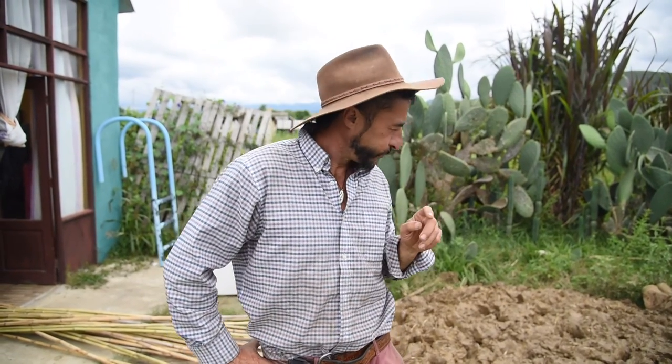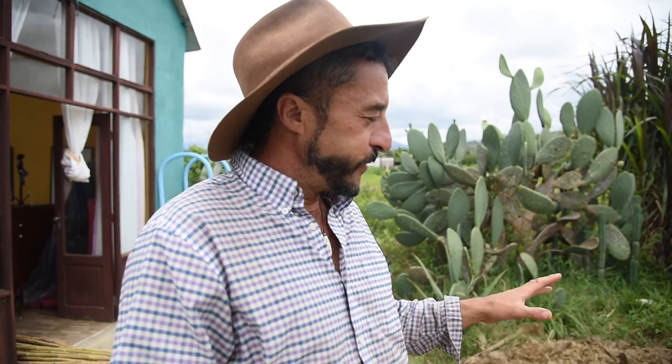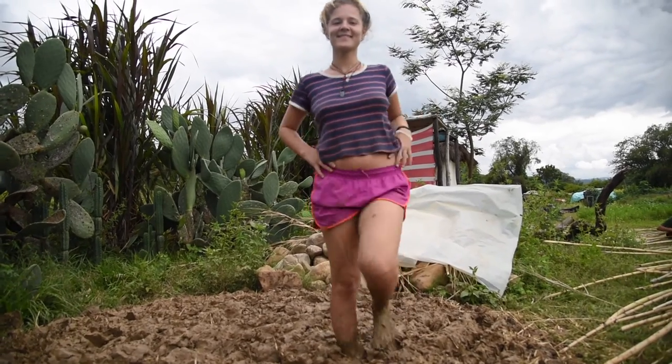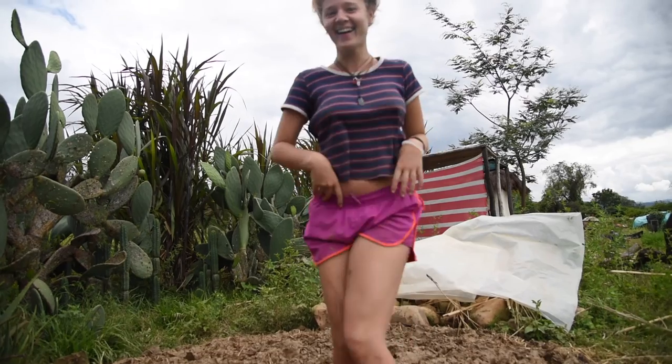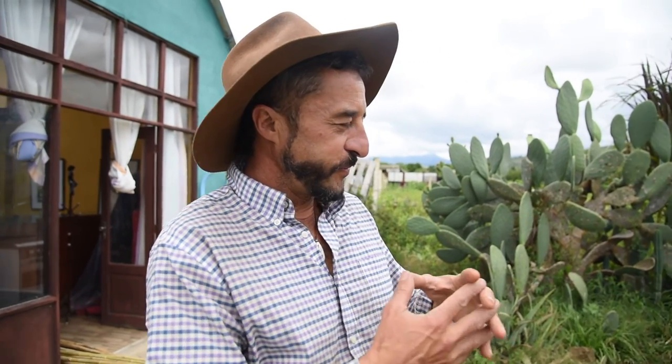So we're using mud which was from when we dug the pond. We made a doughnut with it, first filled it with water, stepped in it, mixed as much as we could, and then left water in it for two days. Then came back and did it again — you can just make it an even consistency without playing with your hands and it's quick. This is the third day — we added a little bit more water, Alice had a little dance in it, and we added some straw that we'd grown here. We've mixed that in and that's going to help prevent it from cracking, because we're just going to put a thin layer above the bamboo.